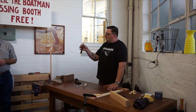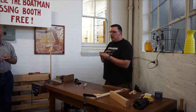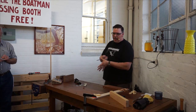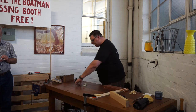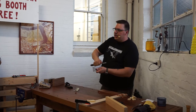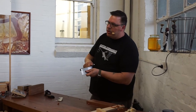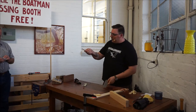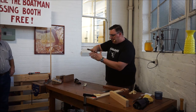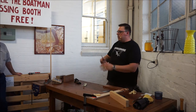A burnisher — this one's nice because it's what's referred to as a teardrop. What that does is you always want to use the widest part of the burnisher that you can. If I can put this on this big flat here, that's the ideal situation. Because if you use the narrow bit, you run into the possibility of galling the steel. But when talking about curves, you want that thin bit to pair. The nice thing about this is that it's got all the different profiles on it so that you have one tool.